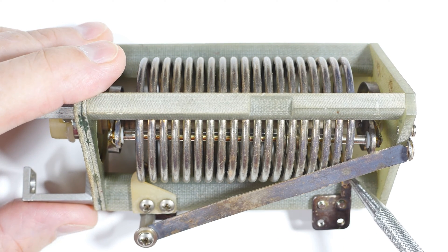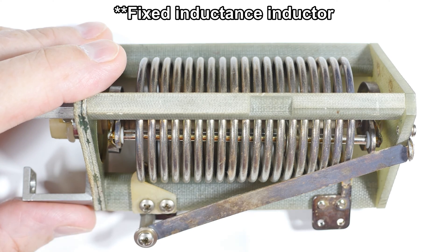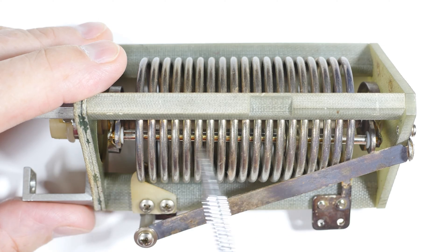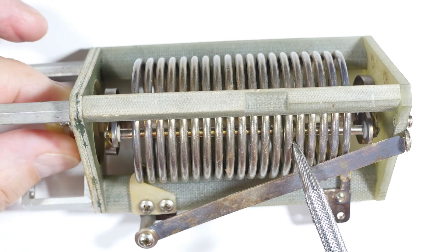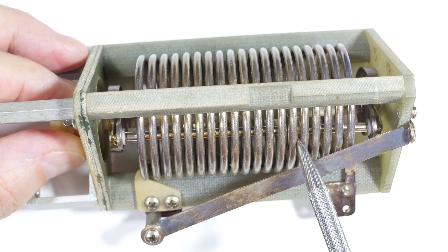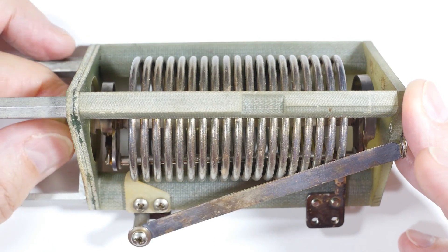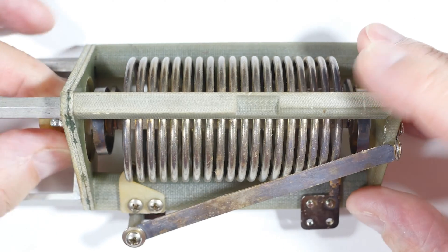This tab right here goes to the top of the coil — it's soldered right here to the very top of the coil. Normally you'd have the bottom of the coil attached in a fixed microhenry arrangement, but with this one you can connect here and then vary where it's tapped along the coil. There's a wheel right there, and every time I turn this it will go up or down one turn on the inductor.